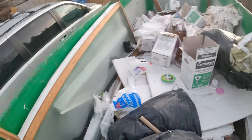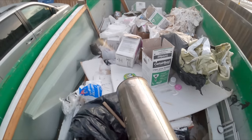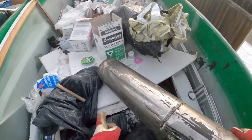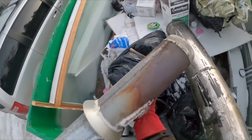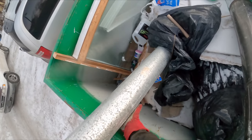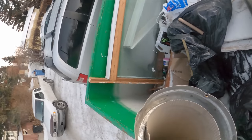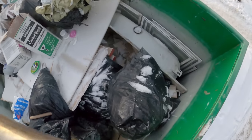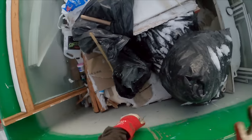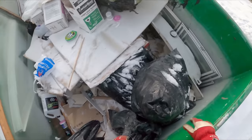A little bit of pipe, but this is the exciting piece — stainless steel, it's a triple-walled insulated stainless steel solid fuel chimney, for a wood stove. Unfortunately it's completely ruined on one end. Quite a bit of creosote build-up. Type B gas vent — a person really shouldn't be combining these with a solid fuel burning appliance. Ask me how I know.